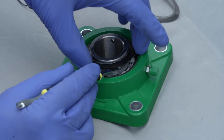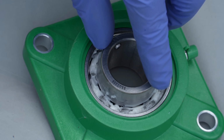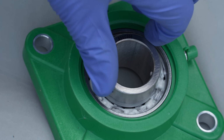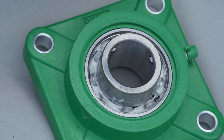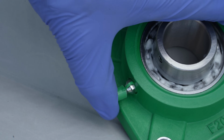Right, so we're inside the bearing cavity. I was surprised that it was greased quite lightly, although I know you're not supposed to pack it to 100% full. This Mobil FM222 globs up into distinct blobs, and obviously this will only grow more pronounced in cold temperatures. The housings are designed with grease gun compatible capped valves on the side, so they can be topped up should the seal slowly allow any escapees.